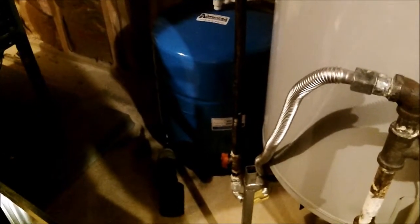I've got the filter box down here — this is it. This particular box gives you the ability to put a door on either side. In this case he's got an expansion tank right there, so you won't be able to pull the filter out from that side. We're going to have to put the door on the back. This side has a panel you can just slip into place. Here's the filter that goes in it — and this is the one-inch filter that used to be in there, so there's quite a bit of difference.